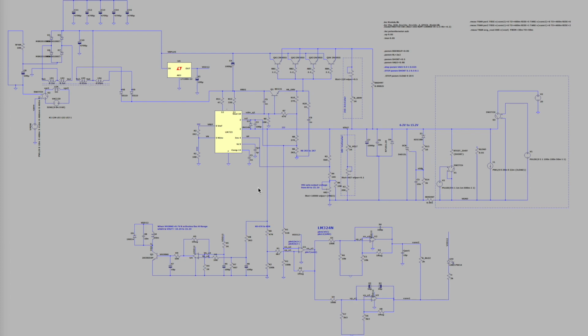Spice version of the schematic shown earlier from the printed manual. This is the simulatable version, of course, that I created. So again, on the left side on top, we have the AC to DC conversion, the transformer, the input supply 120 volts RMS, 84 to 85 volts RMS, the fan, the decoupling cap of 4700 microfarad times 6, the 12 volt output that drives some of the supervisory circuits in the bottom over here, and then we have